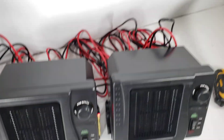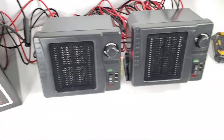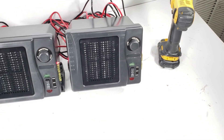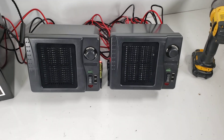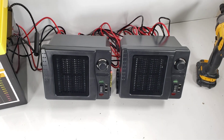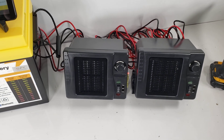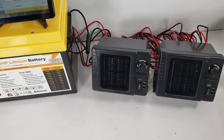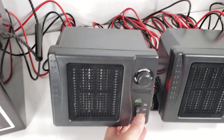One of these will do about 350 watts and the other one is also 350 watts, so if we combine two we'd get around 700 watts, which is about 2C for our size batteries. We usually discharge them around 700 or so watts, so this could potentially work. Let's turn the first one on.